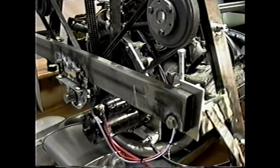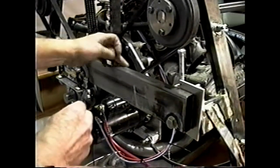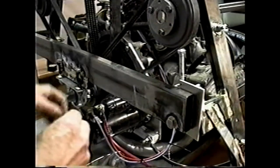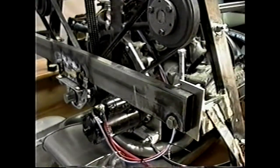and they should be brought up, not as tight as the specifications say, but something like the sound here would indicate. After the lift belts are taken up, the thrust belt is taken up, and of course it's lower sound. Obviously we can't install a propeller here, but this setup is ready to run.